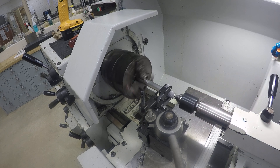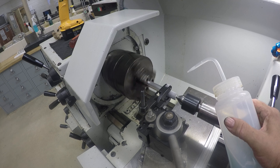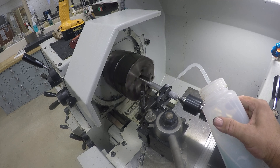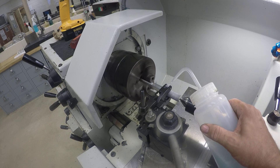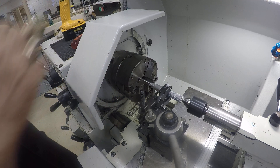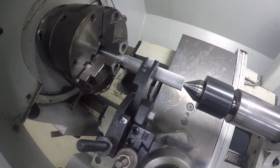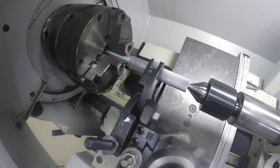So I'm going down. Looks like a decent pattern so far. Keep flushing. The new lathe we have is where we really want to do this because it has coolant that constantly flushes and recirculates. Alright, that looks pretty good — I think this is the end of my travel. I'm going to stop. Now I can take a look at my pattern. What I'm looking for is a diamond-shaped pattern — I want to see a ridge and diamonds. This looks pretty good, so I'm going to say this is done.